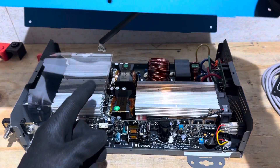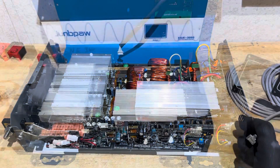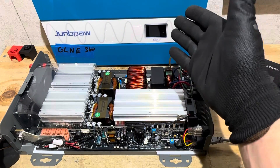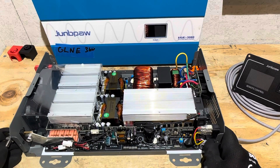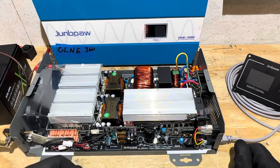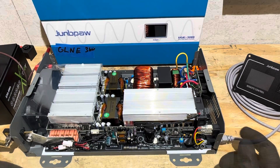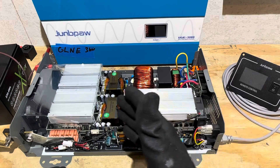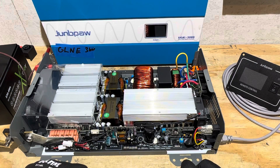I've already pulled the display cord previously, so it saved some time. That display cord ties in right there. I'm going to be using the remote display since I removed the display that's on the cover. The inverter switch is off — let me put a battery on it. So now I have a 12 volt battery powering up the electronics on this inverter, so now there are live components again. I'm going to turn the remote switch on and then turn the inverter on, and then all the 120 volt — or 110 fixed to be 120 volt — stuff will be energized. So now it's dangerous to touch inside.